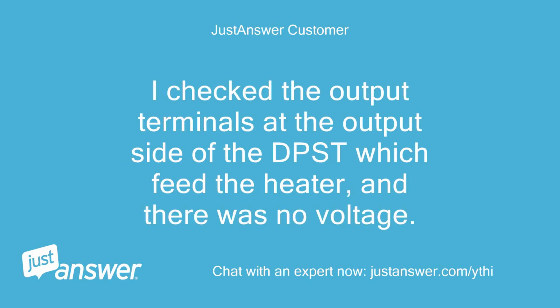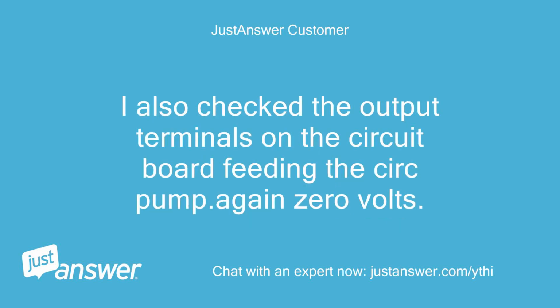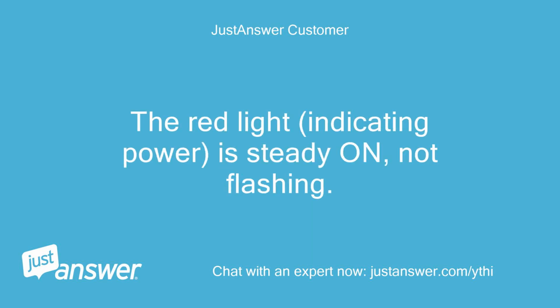I checked the output terminals at the output side of the DPST which feed the heater, and there was no voltage. I also checked the output terminals on the circuit board feeding the circ pump. Again 0 volts. The red light, indicating power, is steady on, not flashing.